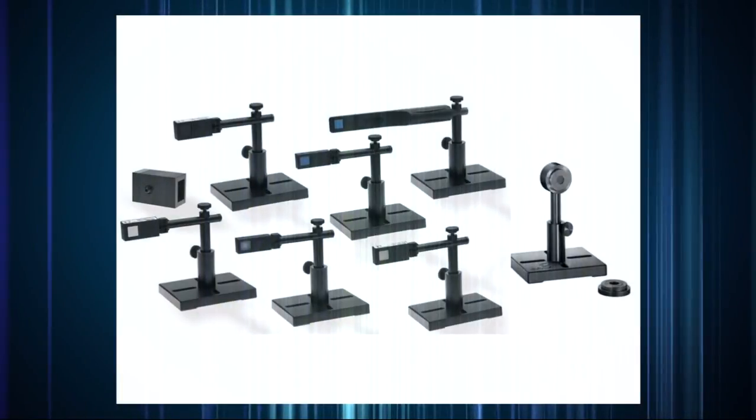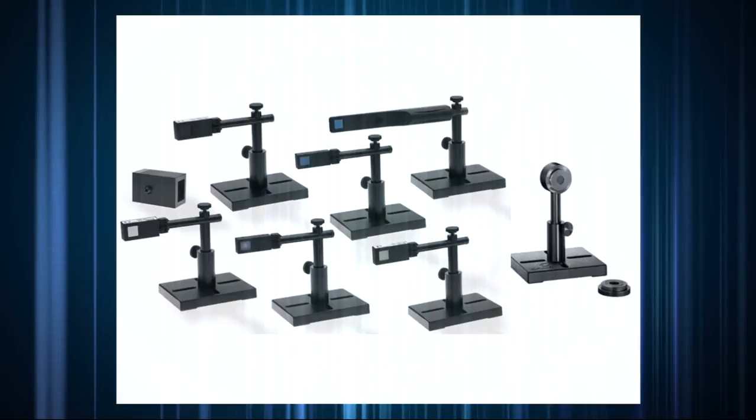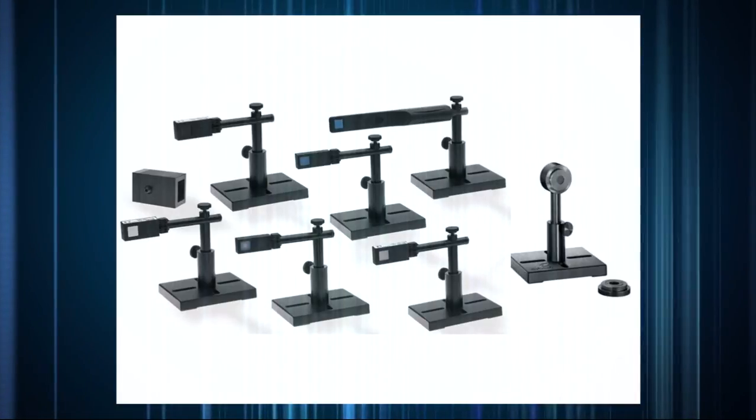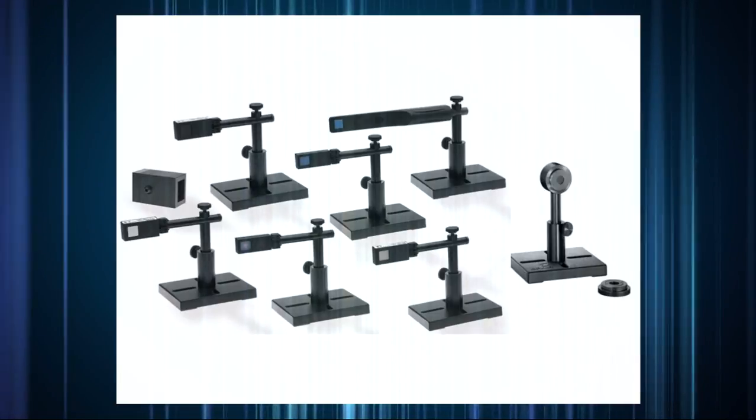This video is part of a series on basics, in which we'll touch on just the bare essentials of laser measurements you might need to do, and the tools that'll help you do them. For measuring power from picowatts to several hundred milliwatts, we use sensors based on semiconductor photodiodes. These make up Ophir's PD300 family of sensors.